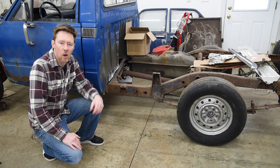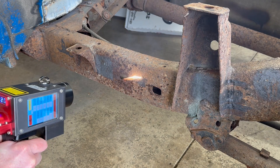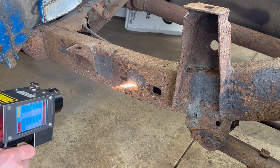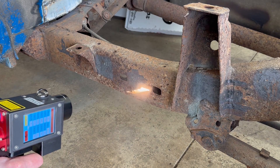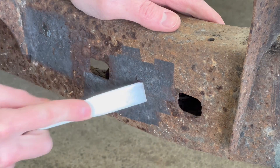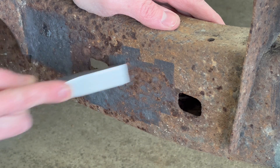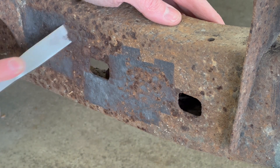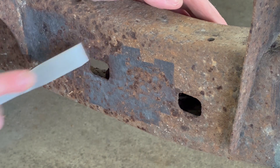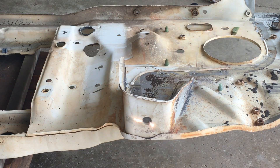As you've seen, I've tested out this machine on all different kinds of surfaces. The only rusty surface that it did not clean well was an extremely rusty frame. Because it's so scaled and ready to flake off, the pulsed laser only cleans the top surface — so it will be rust free, but if I knock off those loose scales, there will be more rust underneath. Because I'm cleaning with light, only the surfaces that the light hits will be cleaned. The only other area where a laser cleaning machine struggles is removing white paint. Because white reflects the most light, it does take a little longer to remove white paint from metal.